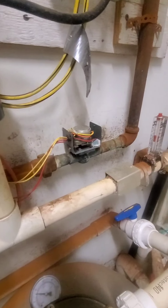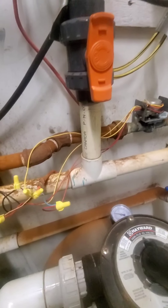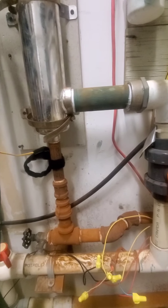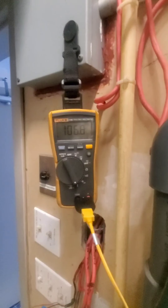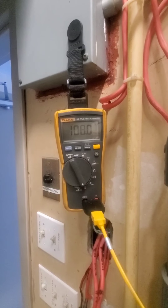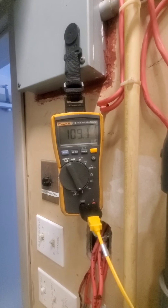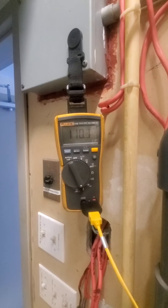That's where my power goes, which goes through the yellows, and then when that zone valve opens all the way it closes the end switch, which goes about 500 feet down the hallway to turn on that pump. And that is the temperature of water I got going through that exchanger.